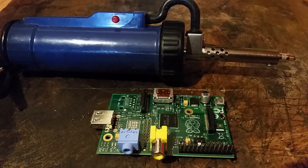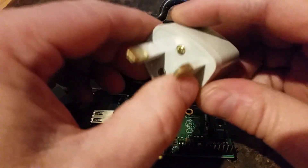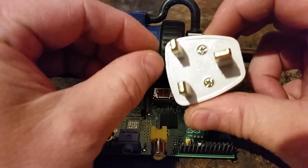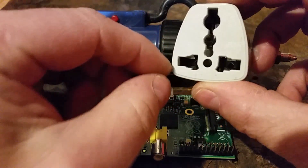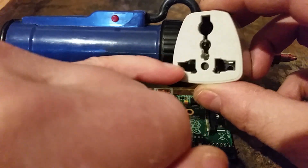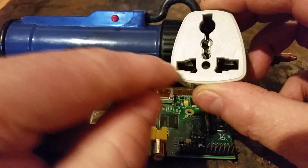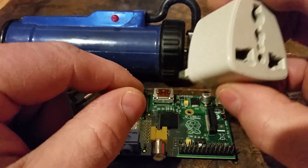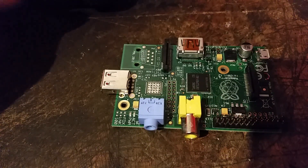The tool comes with a plug adapter, but these adapters are highly illegal. They don't fit safety standards for a number of reasons — firstly the gap between the pins and the edge of the plug is totally illegal in the UK. Moreover, the live mains is exposed inside, so a child's finger could fit in there, and anything metal going in there would expose the live mains. Be careful when you get these because you shouldn't use them — they're extremely dangerous and highly illegal in the UK.